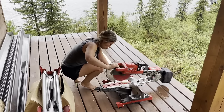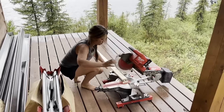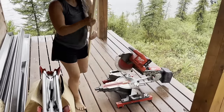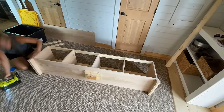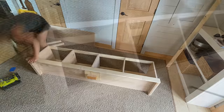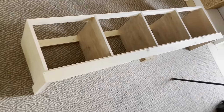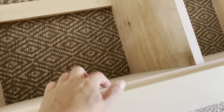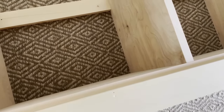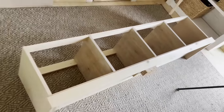The carcass is done and I'm just going to start working on the trim. We'll start with the bottom trim, and I always like to measure and cut as I go at this stage. With the carcass done you have a square project that you can just measure from. I did the sides first on the base and then the front. There was only about a quarter inch to grab into the bottom plywood, so I shot the nail at a slight angle, and I'll be filling all that with wood filler to clean it up.